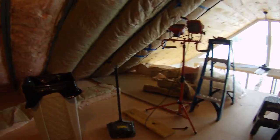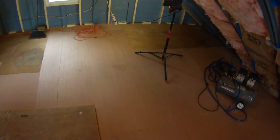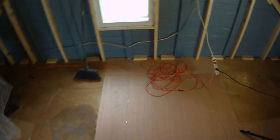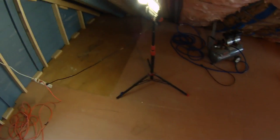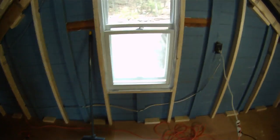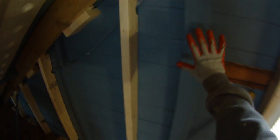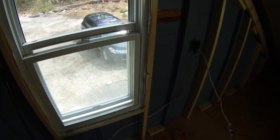Going upstairs, we've started insulating the ceiling, which is tough — finding 24-inch wide insulation is not easy. We've put one-ply 4x8 subfloor sheets down, giving us a nice base so we can lay the laminate snap floor. Before it was very uneven with cracks so you couldn't put anything down. We've also put some two-by-fours up and will be insulating this wall.